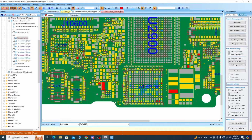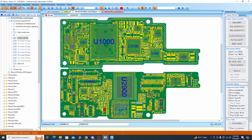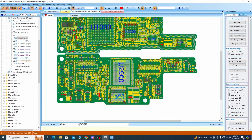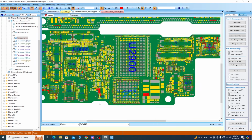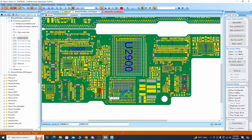So this is how I would normally tell what boost is, by the pattern underneath it, and this is a pattern that makes more sense. So two lines on the corner connect to the coil, the next two lines are boost, and then the other side of the coil and the next two lines are main. Well, I guess not. I guess I'm wrong. Oh, there we go. Yeah, it's the other side. So two lines in the corner are main, and this is absolutely main. Then the next two lines are boost, and then the next two lines are attached to the other side of the coil.